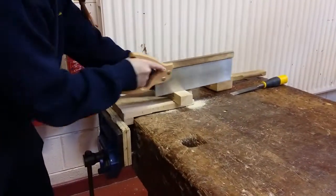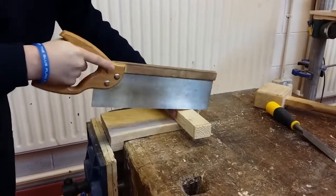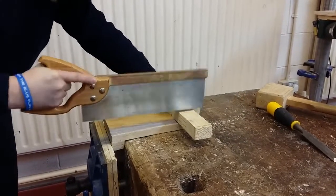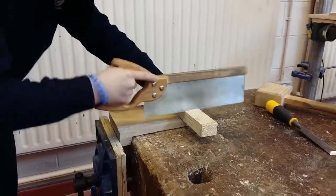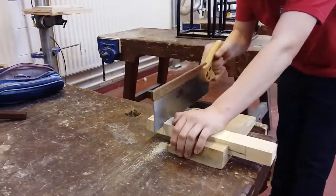We have more shoulder lines being cut here. Good practice — drawn back on the line to get it started, finger along the side, good grip on the bench hook, well positioned. That's all good there so far. A little bit short on the stroke of the saw — try to use the full length of the stroke.